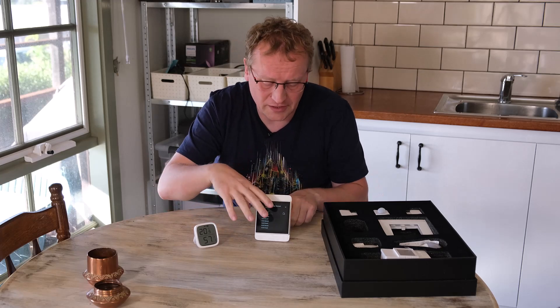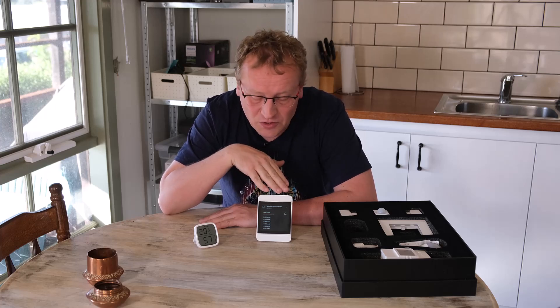Now there are a couple of issues I did find. One is that you have to wire it with 240V, which is actually not allowed in Australia without a licensed electrician — so I've done something slightly illegal by hooking it up, just so I could show it. It can connect to RTSP, which is real-time streaming protocol for cameras, but I use Unifi cameras and they only offer RTSPS — the secure version — which this doesn't seem to support. Also, allegedly it works with other Zigbee 3.0 devices, but I couldn't get it to connect to an IKEA switch, though I have seen others connect it to non-Sonoff things.